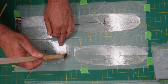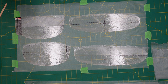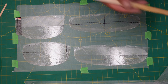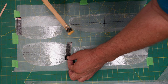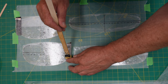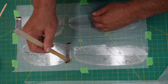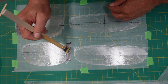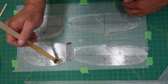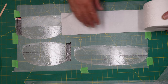You just peel all that off and then I've picked up those mylars and put them on a clean wax paper surface, getting away from the newspaper that's covered with epoxy. I've already put my little carbon fiber skid plate on the bottom of one half of the rudder and right now I'm just applying the other half. This skid plate is really really thin material — I think it's 3K carbon tow.